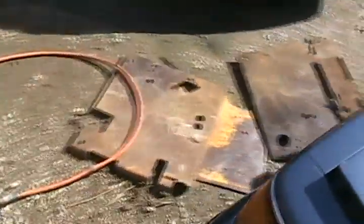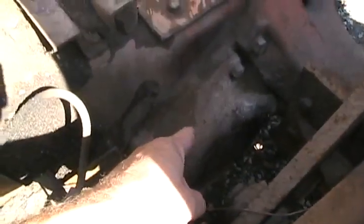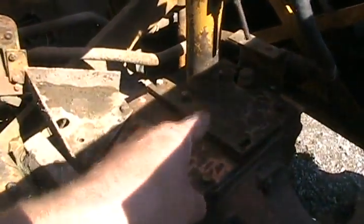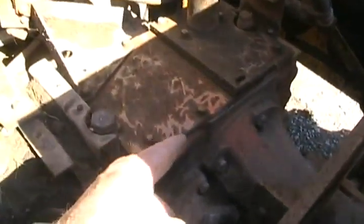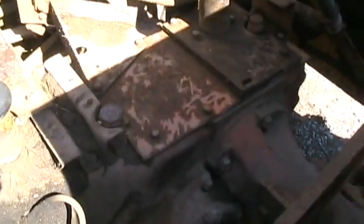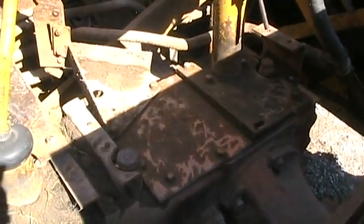We've got the floor pans removed — pretty simple. It looks like any other old tractor down in there. The brakes are on the side of the transmission, not in the wheels like a car. So I've got to remove the seat pad, then this upper plate, and then I can get into the transmission. When I'm into the transmission I can probably release something in the differential and pull the whole axle right out like you would in a normal car. When I get the axle pulled out, I believe I can change that big gear that's in there and hopefully find that missing tooth.